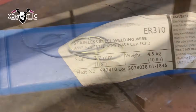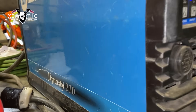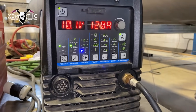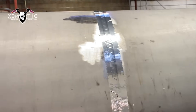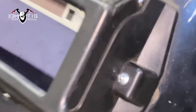We got two hoses on the eight holes, six inches away from the joint — that's pretty good. This is ER310 — I'm going to use a 1/8 rod and welding with this beauty, the Dynasty 210. 120 amps is going to be my start point and I'll adjust up or down five amps as needed. I'm just going to roll that bottom section because it's too tight — I don't want to do it overhead. We're in the shop, so just roll it a quarter and weld as much as we can.